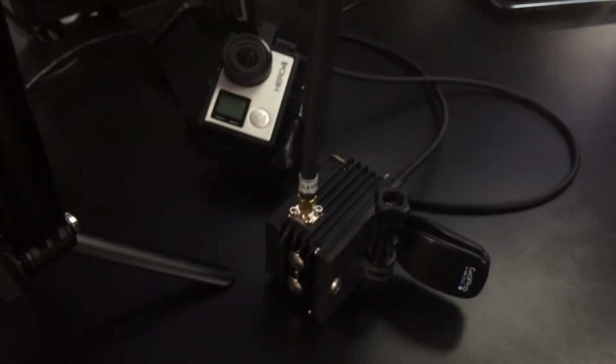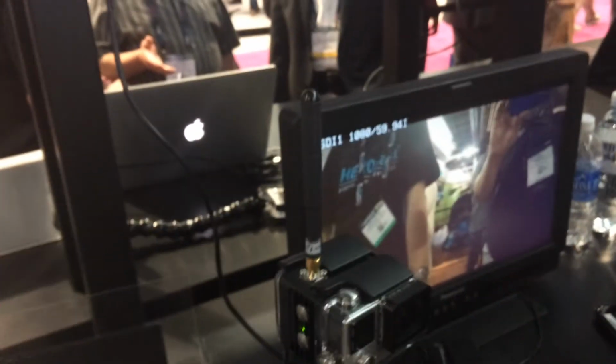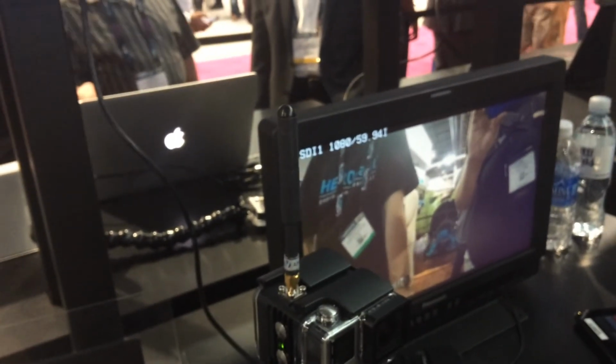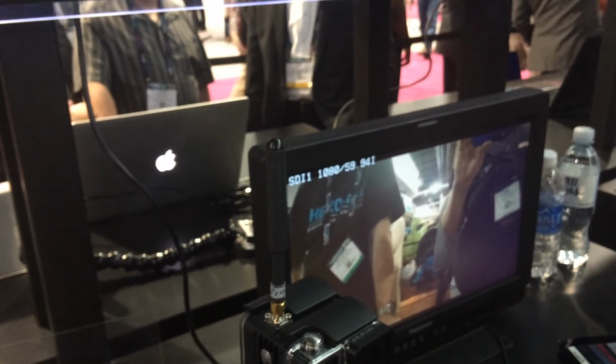The small, compact receiver we have is a 2-input diversity receiver. So it is 1 transmitter to 1 receiver, but the output of the receiver is HD-SDI. So you're doing full, low latency, DVB-T standard, broadcast quality video. Now from a point of view camera for GoPro, which is pretty amazing. That's awesome.